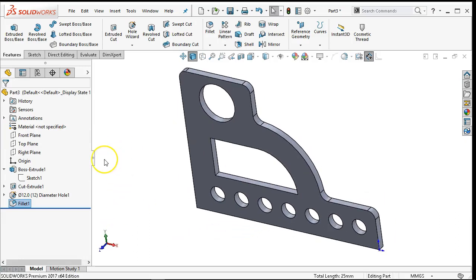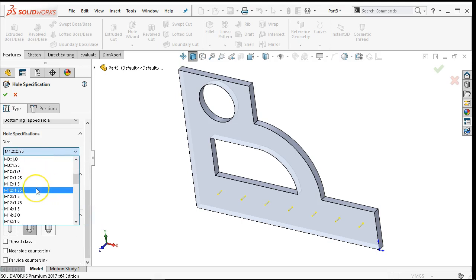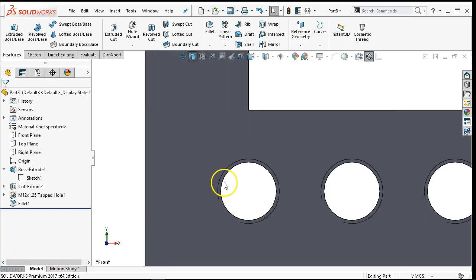All right. So the 5 millimeter thickness is not really that big for a thread callout, but let's go back into the feature and I decide that I want this to be a threaded hole. And so we're still in ANSI metric, bottom tapped, and I want to put an M12 by 1.25 in there. I tell it to show me the cosmetic thread. We can set a thread class. Near side and far side countersinks probably don't have room for all of that, so we'll just go ahead and put it in. The difference is now that I see the tap drill, and then the circle around the outside,